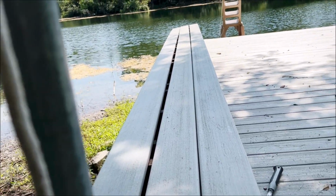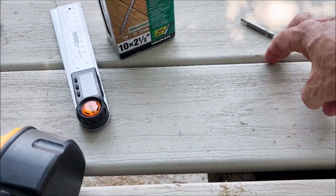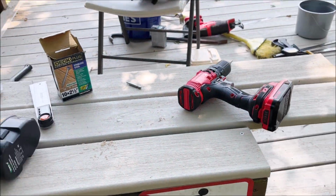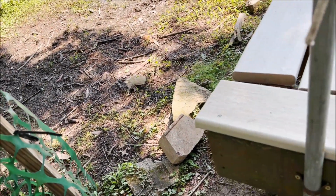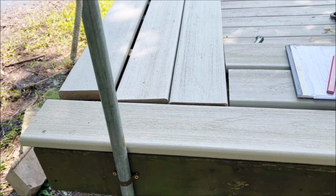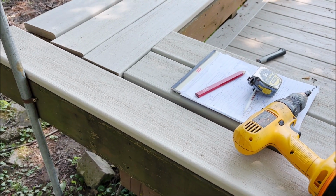That angle looks good. I'll cut that board to angle, and I'll put this board in flush, and then we'll adjust the gap, moving that board back and forth, and then screw it in place. And I'll drop a blue line and cut across there. And then I'll cut these two boards with this angle, and I'm gonna screw this one down first, then I'll screw down the second one after I get these boards done, and then we'll adjust the gap with that center board, and then I'll be done for today. But yeah, that's what we're going to do right now.